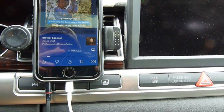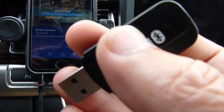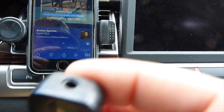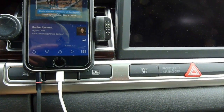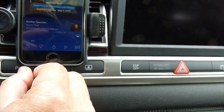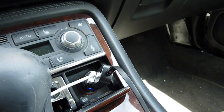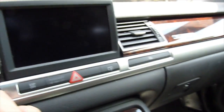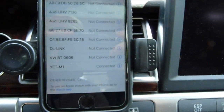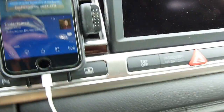Now, it works the same for Bluetooth. Remember I mentioned my Bluetooth dongle was cheap? It has nothing to do with the ground noise — that's caused by the ground loop noise from the analog. So now I plug this one in, take this output, and plug it in here. Still no noise. So I'm going to pair it — now it's connected. Playing music via Bluetooth right now, streaming. Beautiful. Very clean.